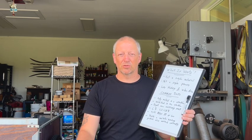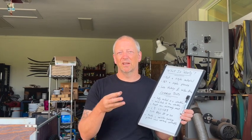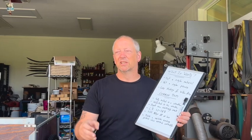Next, it's solidified in the crucible. So this is not a cast product. We aren't talking about melting in the crucible and then pouring that molten iron into something else, into any kind of mold. It stays in that crucible and solidifies in that crucible. In some of the processes, they would tip the crucible to change the shape of the ingot, make it a little longer, easier to forge out, but it was still solidified within the crucible.